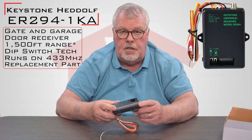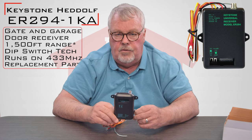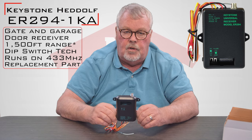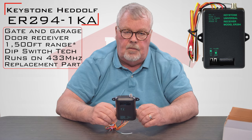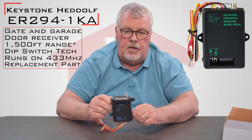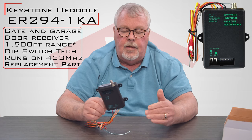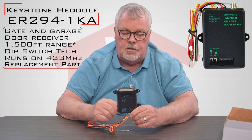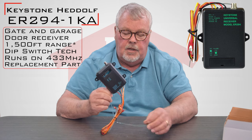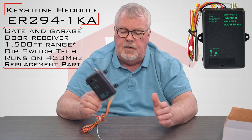As I said earlier, it's a long-range piece of equipment. It runs on 433.92 megahertz, and in the US most radio controls run below 390 megahertz. So they've set this up to run on a megahertz which is up and above the clutter that you'll normally find in a big community. That's partially the reason for such long distance. The directions and advertisements are going to say this is getting 800, 900, 1,000, 1,500 feet.